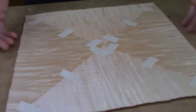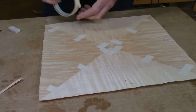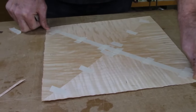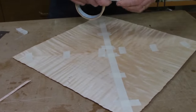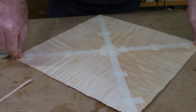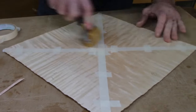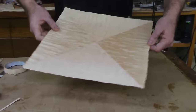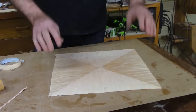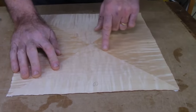Look at that — it's beautiful! Once you've stitched across the joint every two or three inches, go the whole length to really hold it together. Do the same on the other side. Then we roll it out — pretty nice little match! We've got a lot of activity in the grain; it's close but not perfect, of course, but pretty close in places. And there you go — that's the infield. Now we're going to want a two-inch border going around.